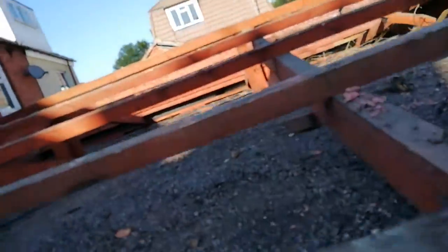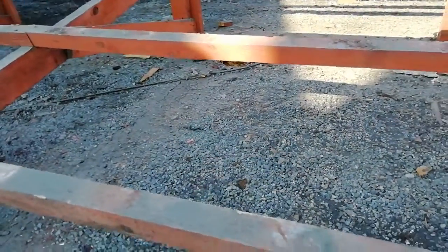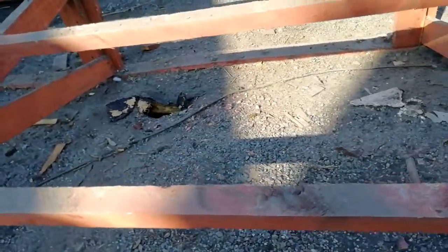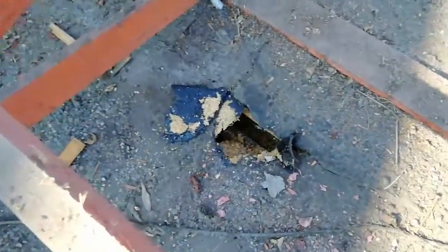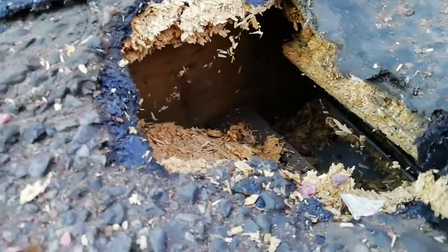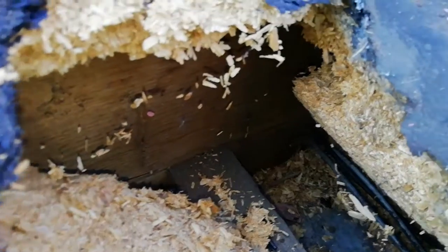We've removed the additional tiles off this tiled roof from above and it's in a dreadful state. We have the old flat decking underneath which always leaks — it leaks dreadfully. Now, there's a hole which I didn't know was there. Within that you can see the old timber. The flash is on; the timbers are looking okay.